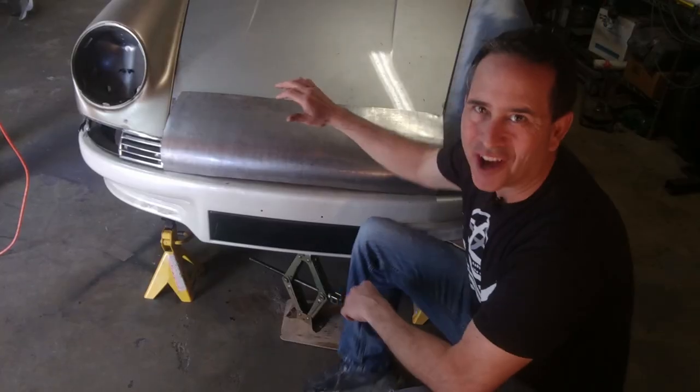Here's a view of the top of the hood showing the hem that has been opened up all the way along. The reason we didn't just cut it off is that this makes welding easier — there's something that protrudes out so we can have a weld here, and then another weld on the inside when we extend the inner skin. This gives an offset.